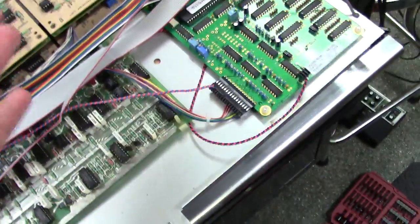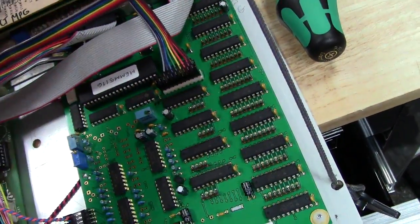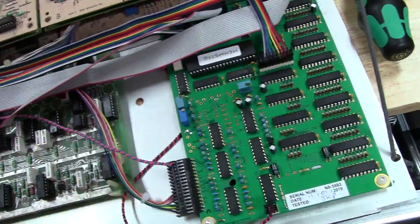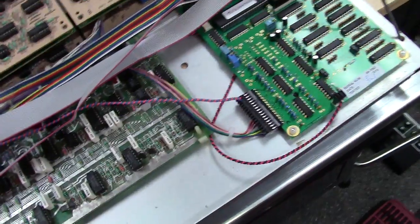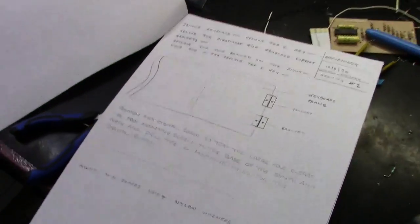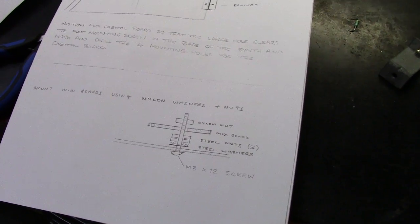Well, if you do that, that's not going to go anywhere. It's going to sit on top of this board, and you won't be able to mount it. So there's no mounting possibility with those leg supports there. So what I did, I just left that one back support here so it can mount here, and then here there's just nothing you can do. There's not really any good mounting design there. So it just got one less support. Now I will say the keyboard's still pretty stable in the chassis without that one bracket, but there's no way around it. When you install this kit, there's no way to install a bracket there.